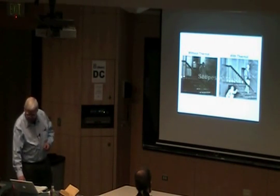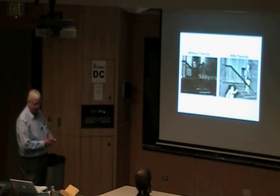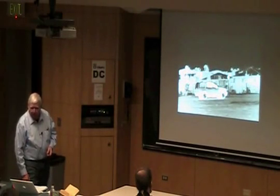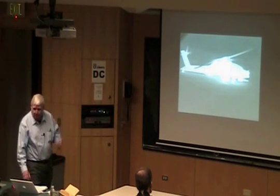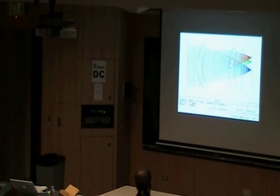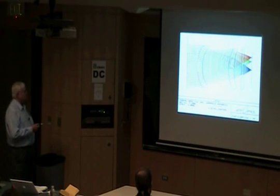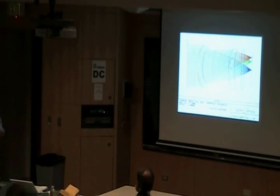Everybody knows what thermal imaging is all about. If you take the picture by thermal emission, you can see things that you can't see in dim light. You can see what parts of a car are hot when it's been running. You can see where the engine is in a helicopter and maybe shoot something at it. And this has been done with a bunch of different kinds of lenses. This particular lens design was just a simple attempt, one that would make a simple objective lens using germanium. These germanium pieces have aspheres on both sides, so you diamond turn them to make them. These are just three different axis angles.